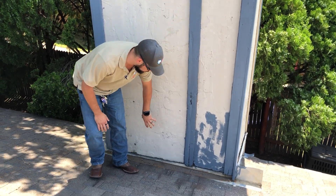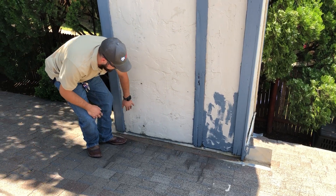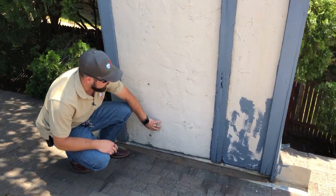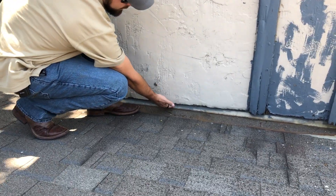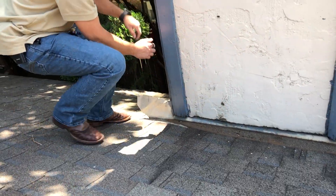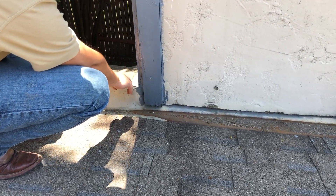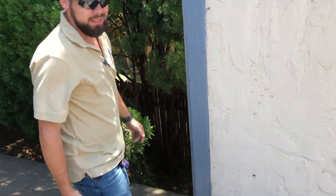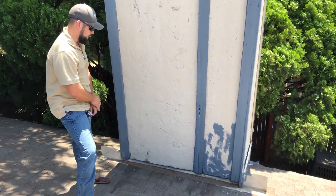So you don't have all your water hitting right here where you can see it's real soft, and if it just rained there'd be a lot of moisture that could lead to mold or mildew on the house. All that water just comes underneath here and starts to feed up underneath. You can already see how far that flashing goes up, and that's actually not recommended — you need to go 18 to 24 inches up the backside of the chimney to help prevent more water leaks coming in.